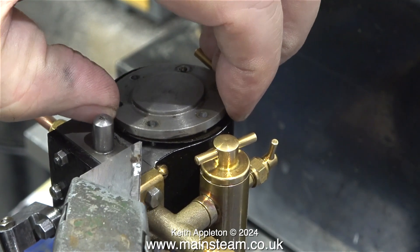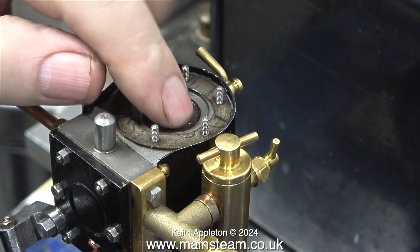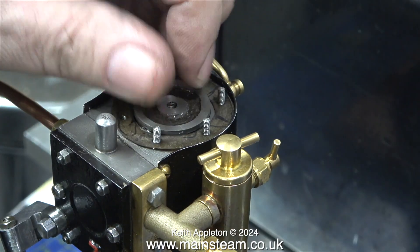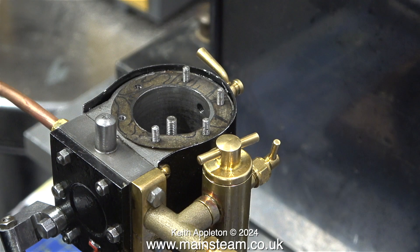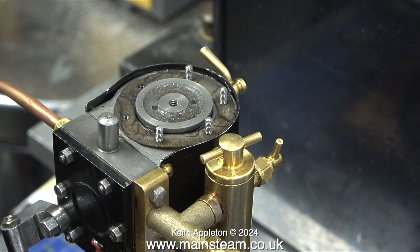At various times in these runs the engine would stop and there was something fouling the piston. There's only one thing to do — remove the top cylinder cover. Here's the problem: the piston is working loose and moving towards the top of the cylinder. There are various ways to prevent this: thread locker, Loctite, or even a centre punch where the thread meets the piston. I asked Andrew to make two holes in the piston — not all the way through obviously, and not into the space occupied by the O-ring. In no time at all Andrew took the piston and returned it with two holes to take a pair of circlip pliers to tighten, slacken, or remove it entirely. I asked Andrew to use Loctite 542 to seal and retain the piston onto the piston rod, but he used 603 or something similar. You can see in the next clip that the sealant is green, which is more of a retainer than a thread sealant.